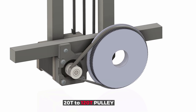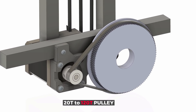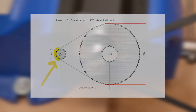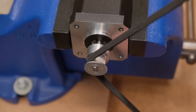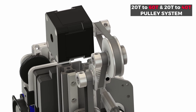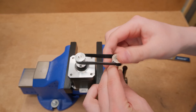At this point the easiest way would be just using a 120 teeth pulley and call it a day. But there is a potential problem. As we are using belts and we need a higher reduction level, we could run into the belt not having enough surface area to properly grip onto the pulley, resulting in some play and excessive wear of the belt. So I just went with 20 to 60 and 20 to 40 teeth pulleys to get the required ratio. However, this complicates things by a mile as we will need to tension both belts somehow.